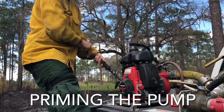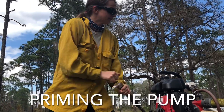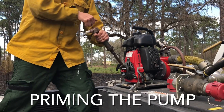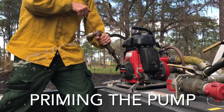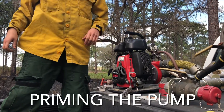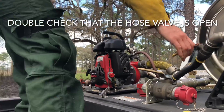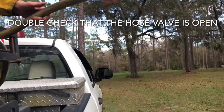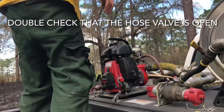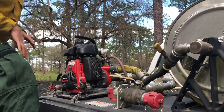The prime should be the only way water gets out while we're using the hand pump — maximum efficiency. You're looking for it to be very hard to pull, and it'll be pulling a solid chunk of water every time. When that happens, it's primed. Next step is to open up our hose and double-check that the hose valve is open. Make sure the prime is good, primer is closed, recirculator is still closed so we don't lose it to gravity.